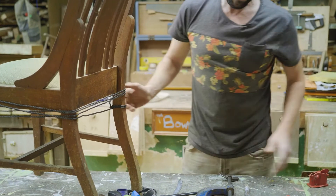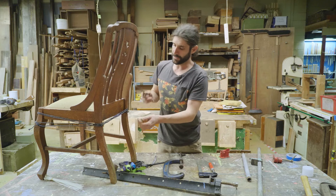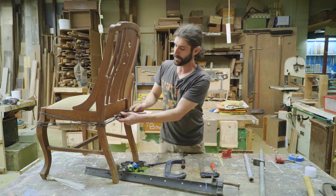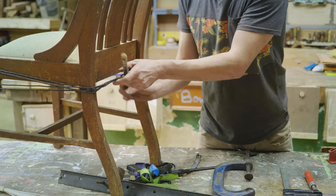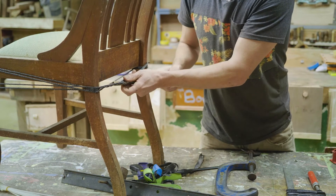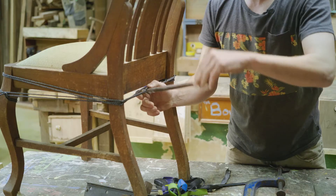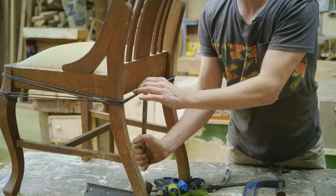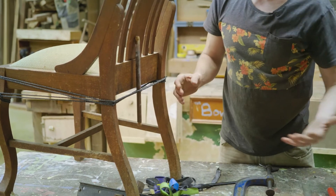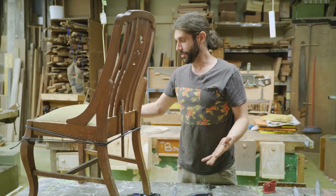I've got that tied on but now it's still pretty loose. So what I'm going to do now is stick this stick in between these ropes and I'm going to start twisting. And what that's going to do — as the rope twists and twists — it's going to get tighter and tighter, and it's actually going to provide a lot of clamping pressure. Like that. And then that's held in place. That's nice and tight and you've got clamping pressure on your chair.